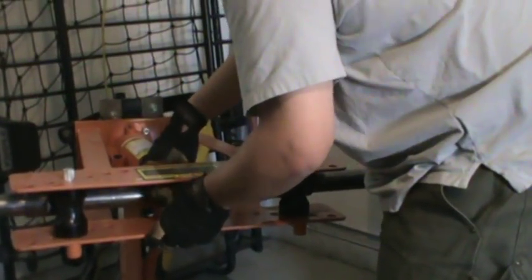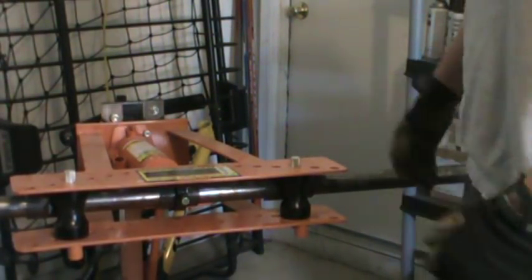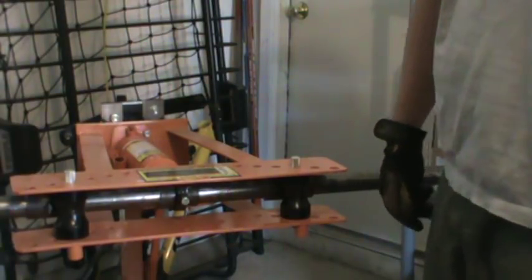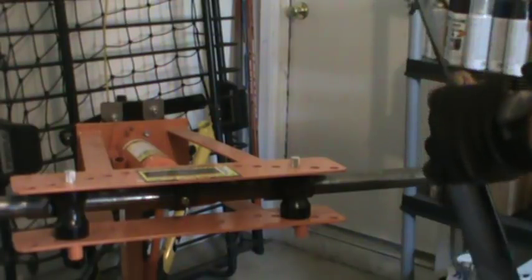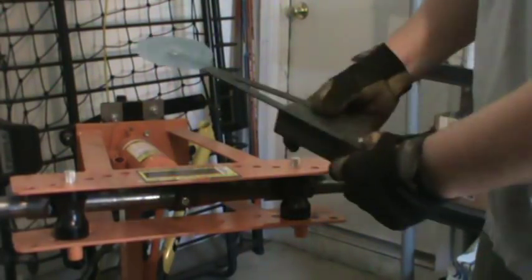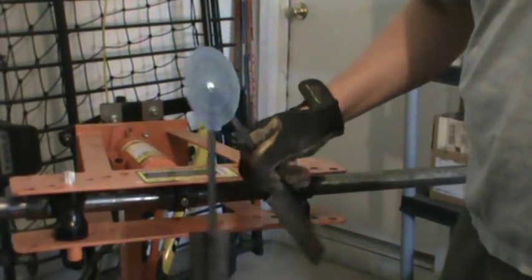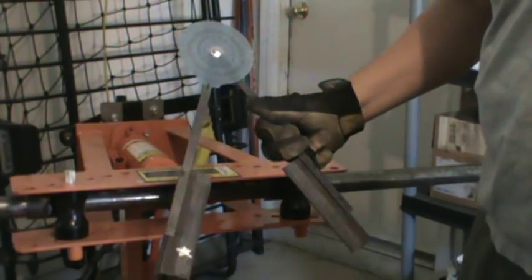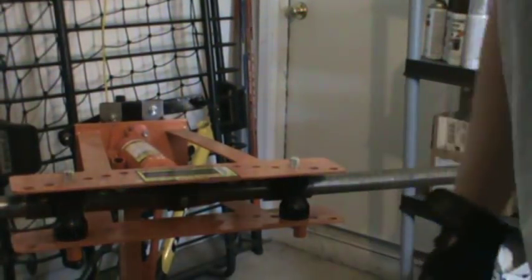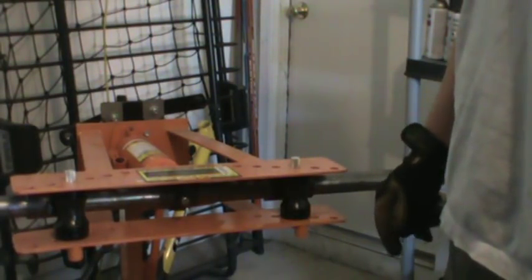Alright, tube's in place, got your collar on and locked down, got your pipe in there. You can use an angle finder to make sure you get the degree you want — you can turn it on its end upright and actually use an angle finder. Or I built my own homemade protractor out of some one-eighth inch steel I had laying around and just a normal protractor, with a hole through the middle that I drilled out a little bit bigger. I have my little mark on here so I can tell what angle I'm at.